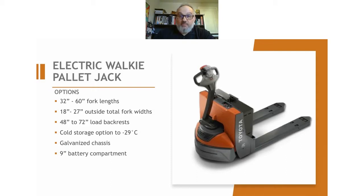If you're bouncing around the streets on delivery trucks, or if you're not confident that your people are going to maintain the battery — watering and such — you can upgrade to a maintenance-free pack. Maintenance-free meaning not having to water it, with a glass mat substance, or you can go all the way up to a gel pack. They're all still four 6-volt batteries and can be replaced with the same when the batteries fail. If you want to try something different, just make sure the technician reprograms your truck to let it know what type of battery you're using.